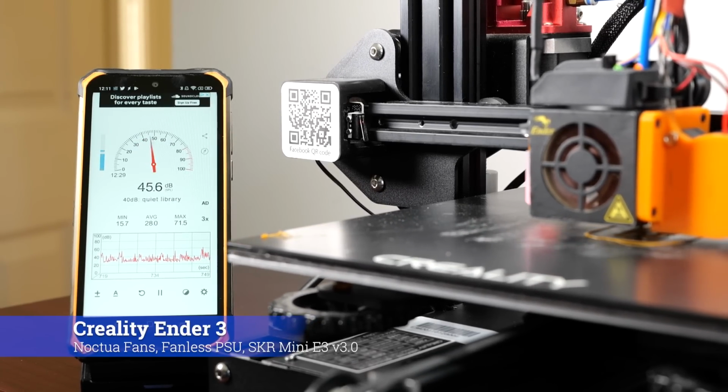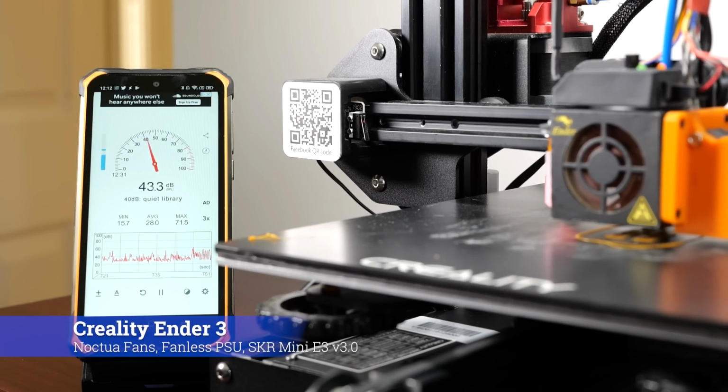It would, but I also discovered one of the disadvantages. While the fan at 100% was absolutely silent, as soon as I started to PWM control it, it would create a little bit of noise. It was an unwanted side effect of the whole experiment, but other than that I really have no issues with it. It's a noise that I probably wouldn't even notice on the regular setup, so I take it as a win at this time. I was only surprised because on my bench I was using voltage to drive the speed of the fan, and that wasn't giving me any issues.